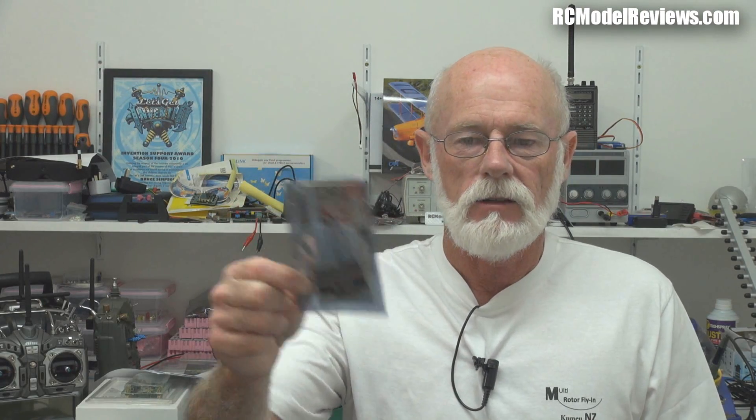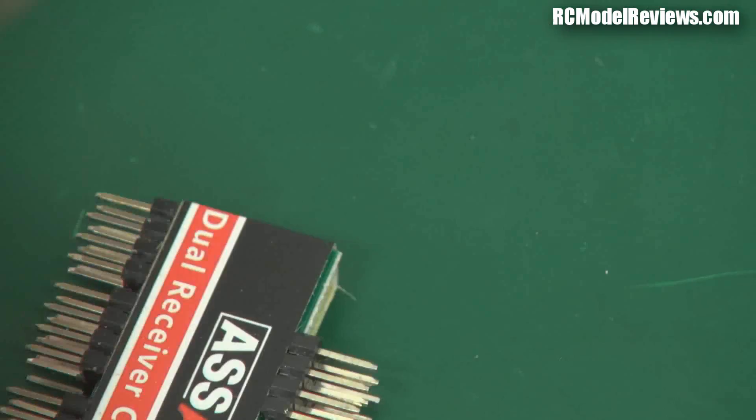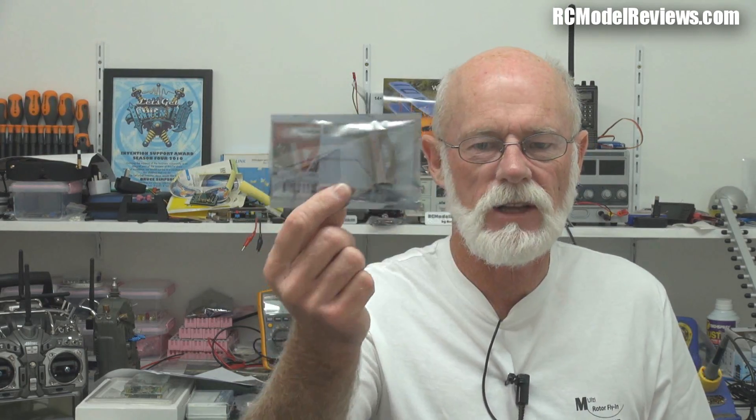Although most of you know how to fly, sooner or later you're going to have to teach others. You've got a responsibility to pay back to the hobby and teach other people to fly if they want to learn. I'm looking at something like this — a buddy box system where you can put two receivers in one model and two transmitters, no leads or wires between the transmitters. The benefit is it overcomes the problem where someone shows up running a JR or Spektrum system and you're flying Futaba — the channel ordering is wrong. With this, you can run a Spektrum receiver and a Futaba receiver and each transmitter works perfectly, switching between them as required.